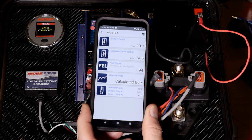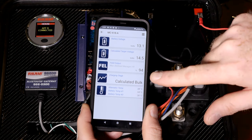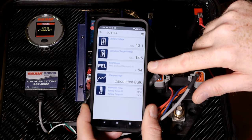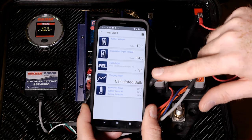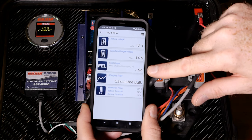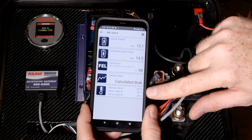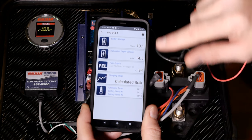Here's the real-time data. You'll see the battery voltage and the calculated target voltage — this is what we're trying to reach in the current stage, which is also shown down here as calculated bulk. We're showing the max field output in gray letters and the actual field output in black letters, and then temperature settings of the different probes.